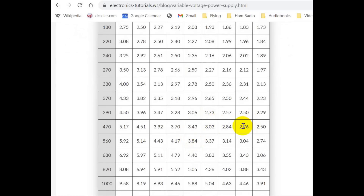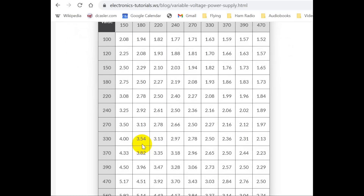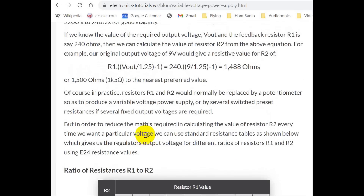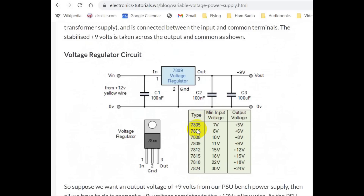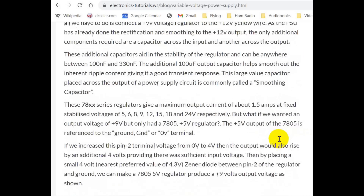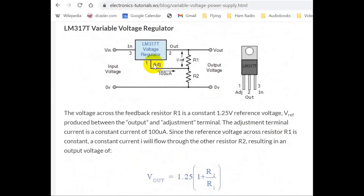You could put any kind of values you want in here to get any voltage you want. Real common today in a lot of circuits is 5 volts, so you can do that with this variable regulator. Or you can just use the 7805 and create your 5 volt output — you see those are at fixed voltages. Whereas the one we are using, the LM317T, is adjustable. We're doing that because I want 4.5 volts, and it's not something that comes out of a handy package.